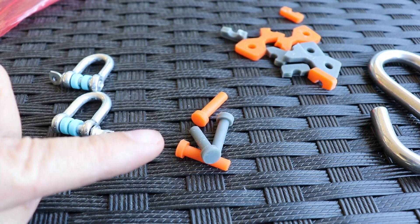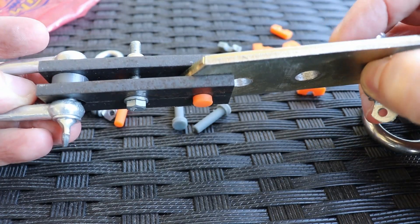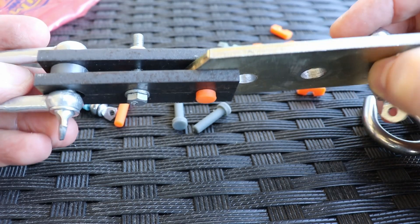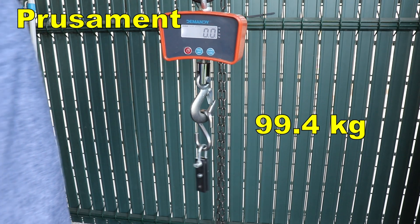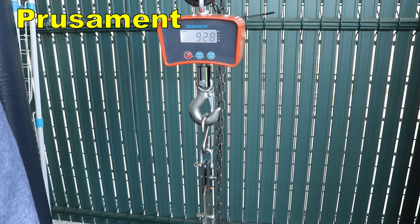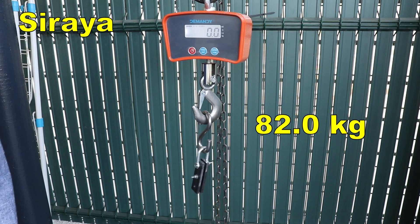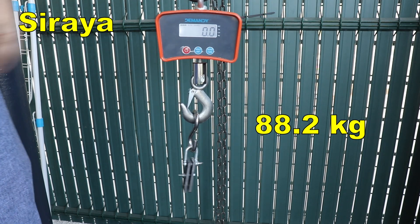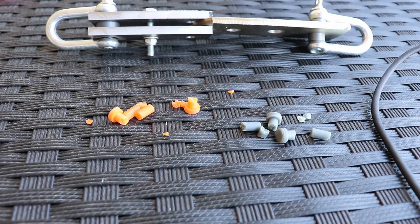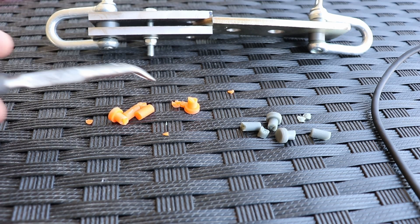The diameter of these test specimens is 5 mm. It is a double-sided shear stress test where I have double the area of that 5 mm diameter. This is what's left from the test objects — as usual with resin they just explode, but they sheared properly on at least those two cross-section areas. After breaking you saw a lot more pieces.